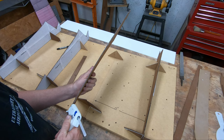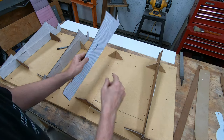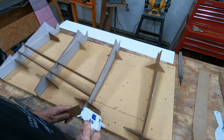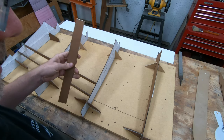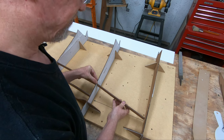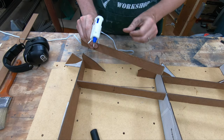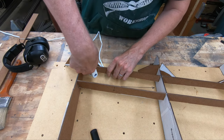For these cradle ribs I only needed a little bit of hot glue to hold them in place and keep them from sliding around. I already had some verticals running orthogonal — 90 degrees — to the ribs to help hold them upright. I then added stringers along the trailing edge: the first stringer right underneath where the plug would rest, because there'd be a little bit of pressure there where I was sticking in plasticine between the trailing edge of the plug and the plastic sheet for my flange. A second stringer further back helps support the plastic flange so it won't bend too much as I squeegee out epoxy on the fiberglass.